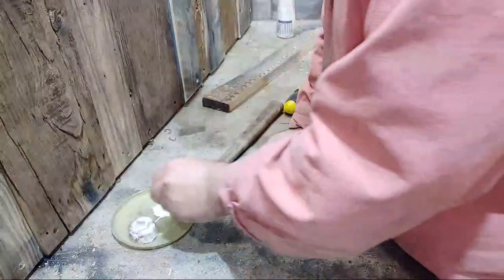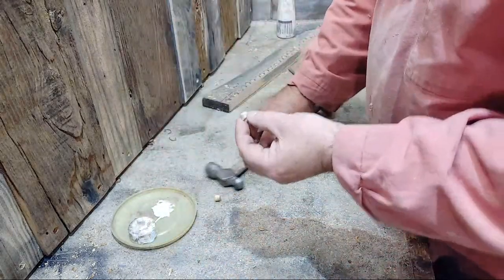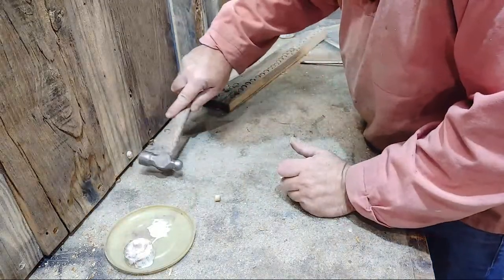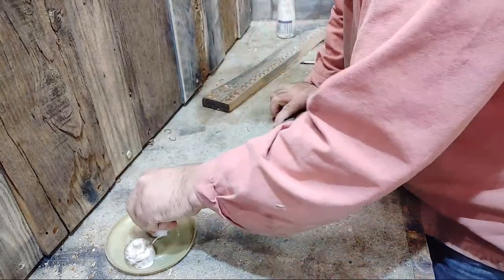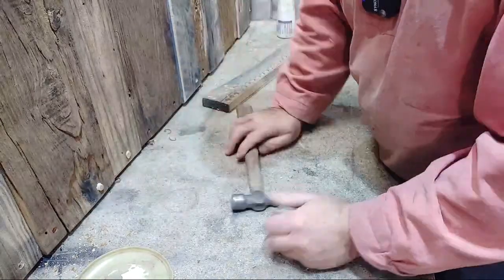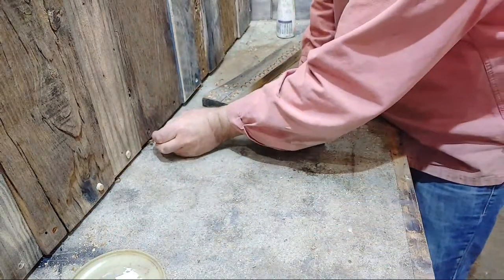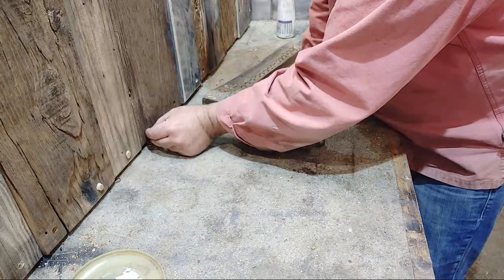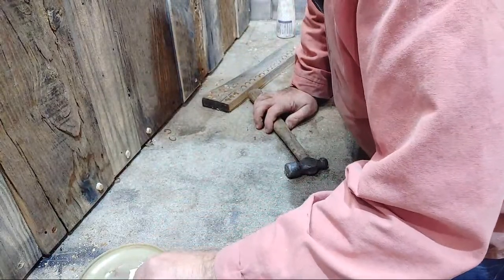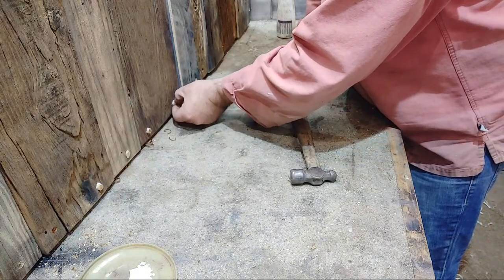Although, I'm not very good with my fingers because since I had the carpal tunnel operation, I'm a bit fingers and thumbs. So let's find your hole. So there's one there. Try and keep the grain in the same direction if you can, and then tap it in. Done. Next one. And you can remove that afterwards with either a chisel or just sand it flat. It's up to you. They're a bit big, these plugs, in the sense they're a bit long, but it gives you something to hold on to when it's longer.